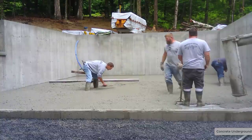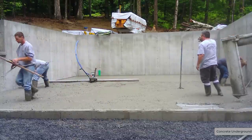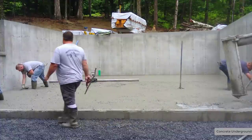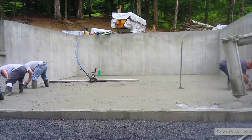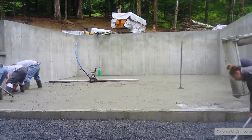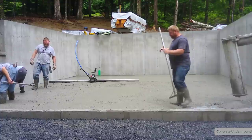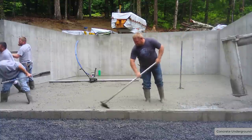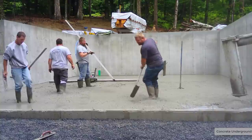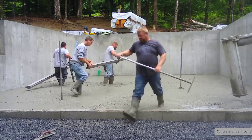I'm shooting my wet pad in the middle. It makes it a little more difficult right over that thick bar there — you can see Darren stepped down in there, it almost went over the top of his boot. Once you get it filled with concrete, it's hard to remember exactly where it is. We're all mag-floating the edges — before we can get it screeded, we've got to have a pad to go by. We'll get our edges all magged out, and that's going to give that battery-powered screed something to screed off from.